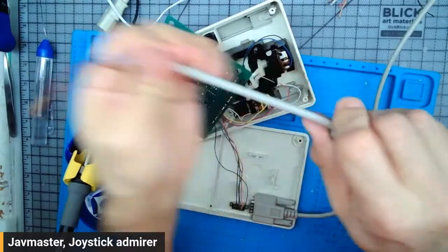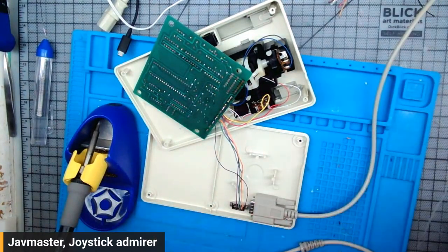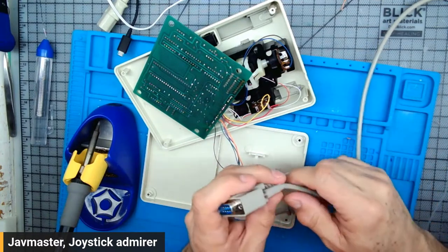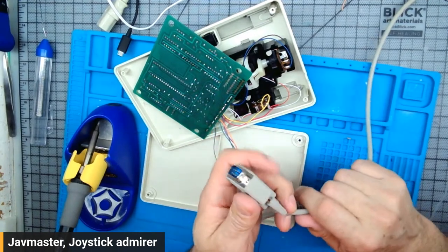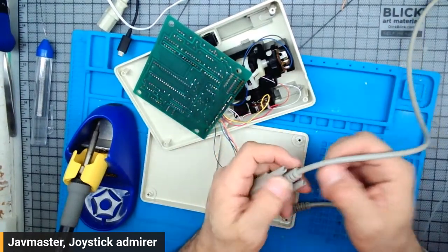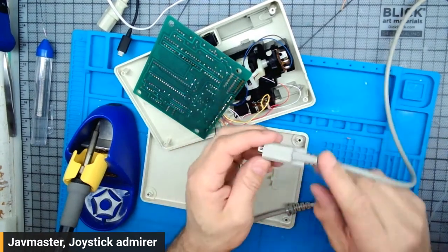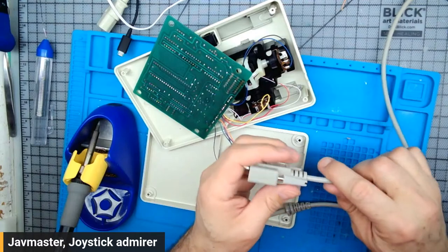And that's another thing. There was a guy last week or this weekend on the Facebook group asking how to fix a joystick that is broken, where when you move it like this it does work, and then when we move it the other way it doesn't. So maybe that's because one of the cables is broken on the inside. And the truth is that you're going to have to cut it out, because there's no way that you can go in without destroying it and re-solder or put it together. So what you do is you cut this out. It's some work, yes, but you've got to do it. Either that, or you will have a faulty joystick all the time.